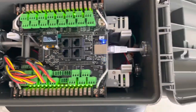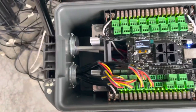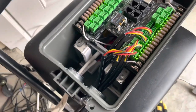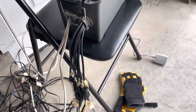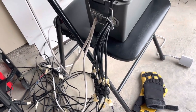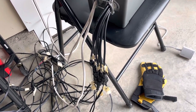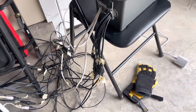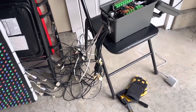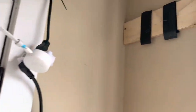It's got the k32a-b mounted on top of a 3D printed post system, which is then on top of two Meanwell LRS 350s that are 12 volt and in their own 3D printed holder. I've got eight pigtails driving the array, and then two power injection white cable feeds that run the top and bottom portions of the array for even voltage, minimizing droop.